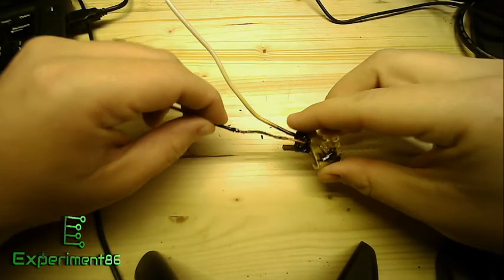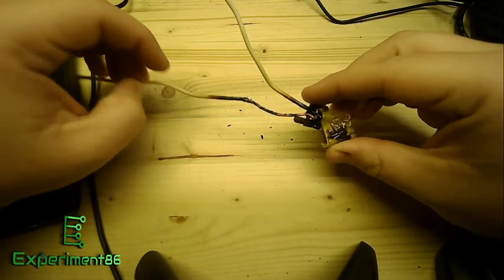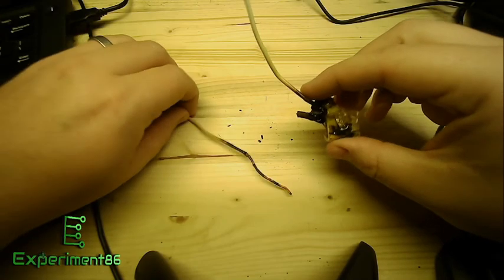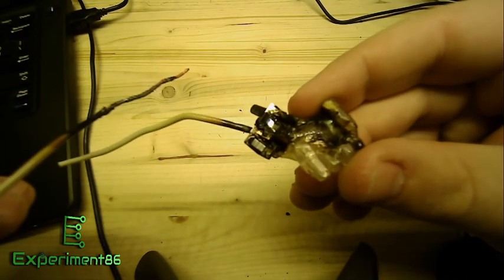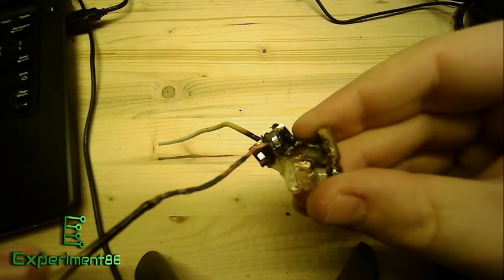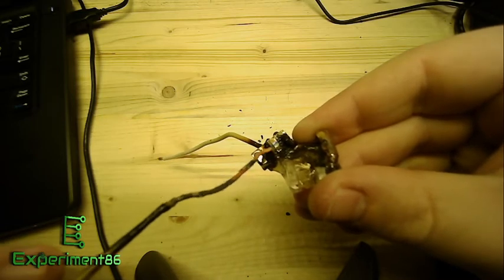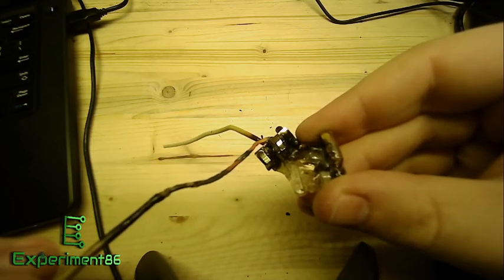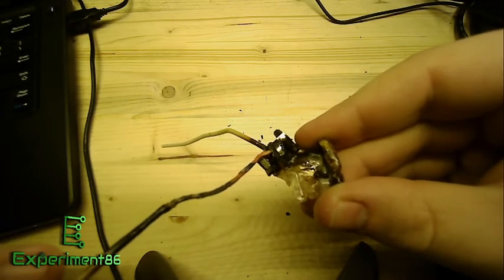When it was connected, it was connected like this. This wire came from the neutral on the load side — from my office — and this wire went out to the neutral bus in the panel. You can see there's some discoloration here, in this little band that presses into the wire — you can tell it got hot. This one didn't have a wire connected to it and it's still silver, but you can see a straw color up to a bluish-purple right there.